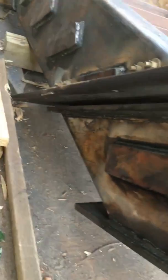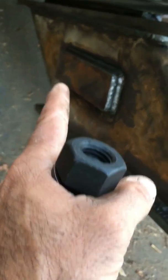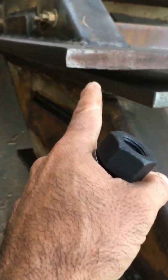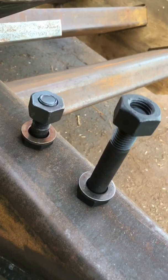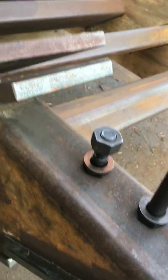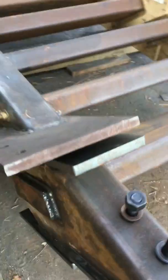There's the slot there. Now this step here is for the top platform and that goes to the underside of the roof beam, and then that slots in. These are the erection bolts — we're going to be using three-quarter inch to bolt through the flanges up on the beams and to bolt the staircase stringer.